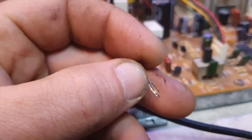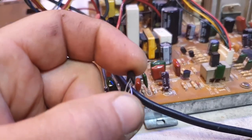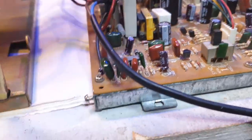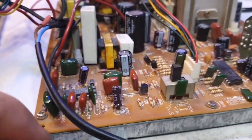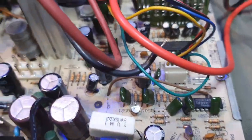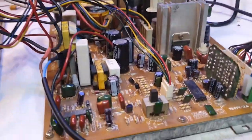Even when I checked the data sheet, I thought, well, maybe the voltages across emitter, collector and base and all that kind of stuff match. They don't really. I know you can do that to some extent, but with something as critical as a monitor, you want something with just the right specs, exactly what's in the schematic. So I pulled one from this one here, and I pulled the coil from this one, and well,